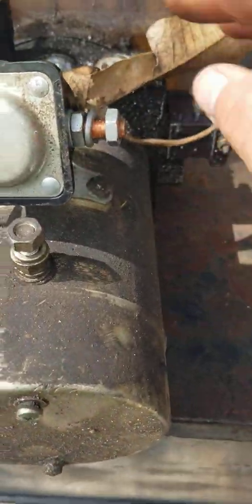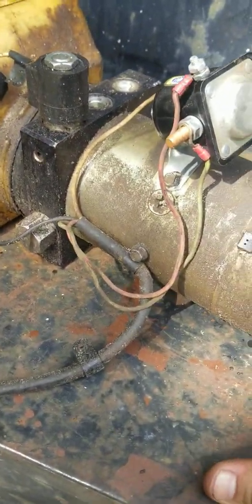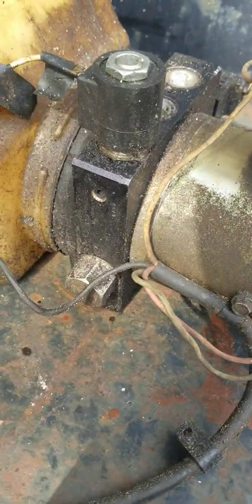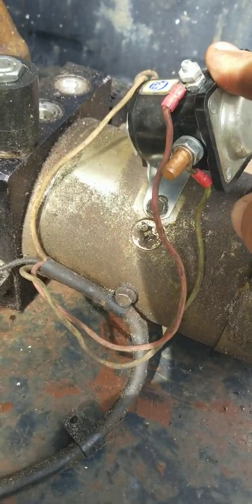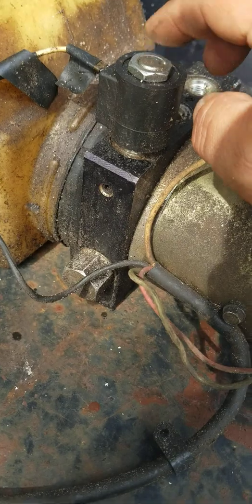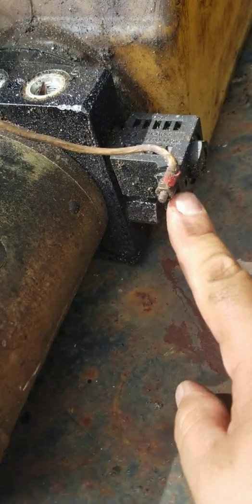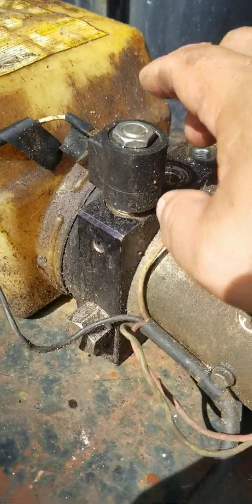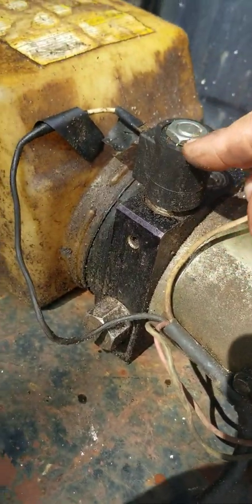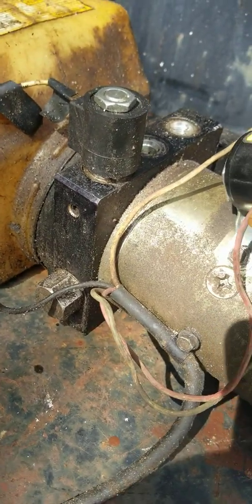This was the old pump. It's been on there since I bought the trailer — maybe eight or nine years ago, so it did what it did. I ended up buying a new solenoid because it started going out. I also bought the valve cylinder — this is the original square one, and I bought a replacement because it wasn't going down; the valve cylinder was bad and wasn't making contact.